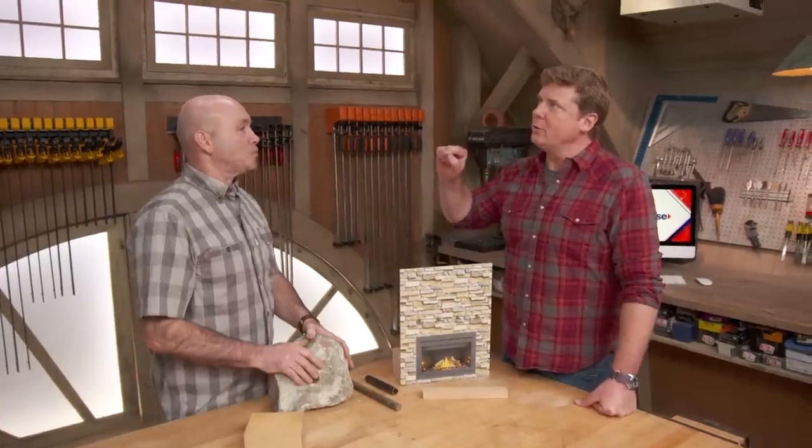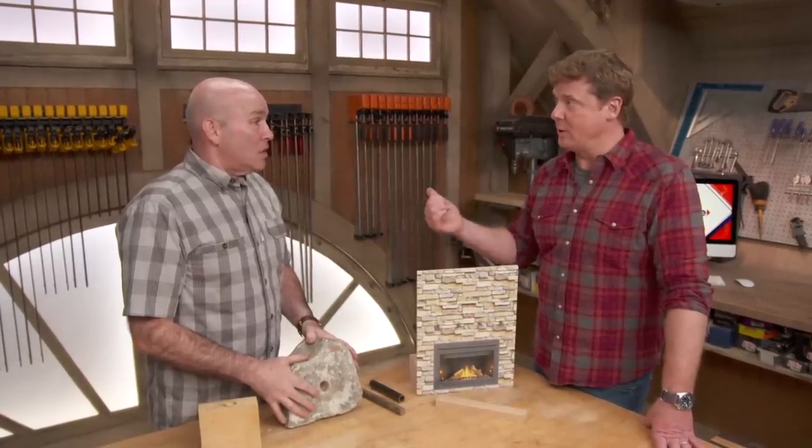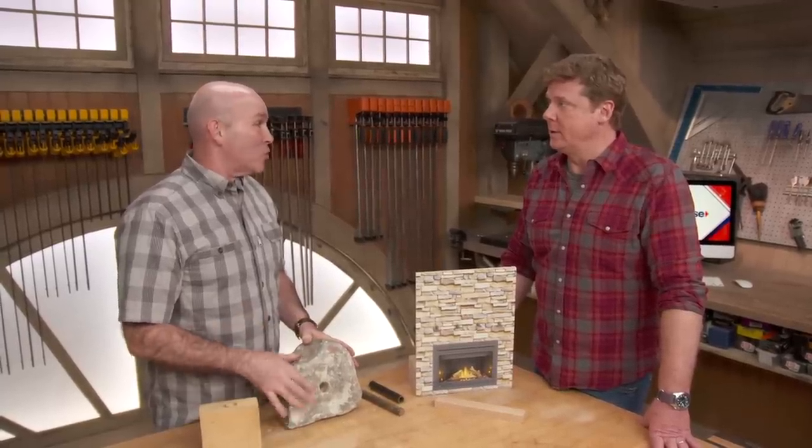So just a couple of questions: why did you deliberately drill through the mortar and not the stone? I would think the stone would be more solid than the mortar. I assess every situation as soon as I walk in. The first thing I noticed about that job was the stone — although it was nice and thick, 8 to 10 inches, it was very brittle. That's why I made the decision to go in between the stones and hit the joints. Had it been beefy stone or brick, I definitely would have drilled right into it — New England has great stone for that application.